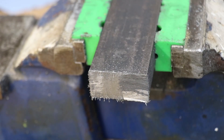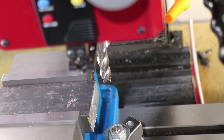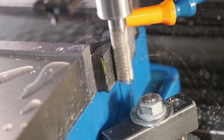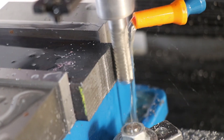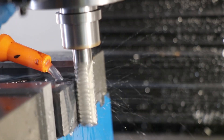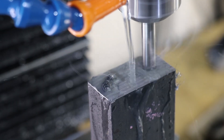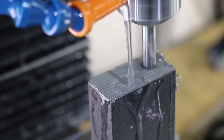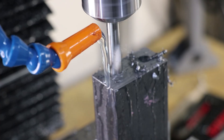The cut is a little bit rough so I'll clean it up in the middle. I'll be using M10 bolts to hold everything in place, so I'll drill two 8.5mm holes in the top and bottom faces and tap them later on. I'm a little bit limited by the vertical travel on this mill, so I'll have to break out the stub length drills to drill the holes.